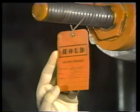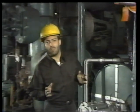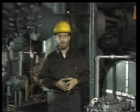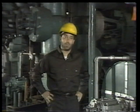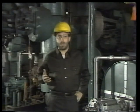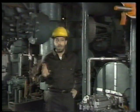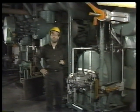The next step is to have the pump stopped and tagged out. An operator or supervisor will be responsible for having machines secured and tagged out properly. The tag means the pump is down for service and shouldn't be started again until the tag is removed by a designated person. So far we've seen the first two steps for any kind of bearing maintenance: checking the symptoms while the machine's running, and then shutting it down and tagging it out. Now we're going to follow this job right through to the operational test.